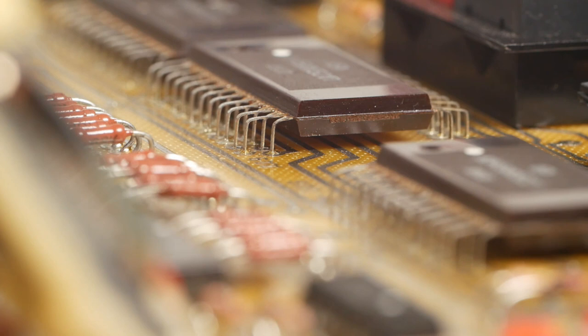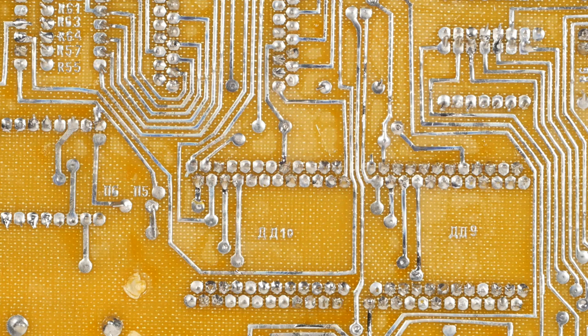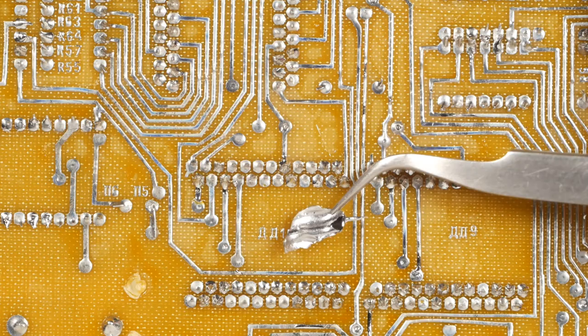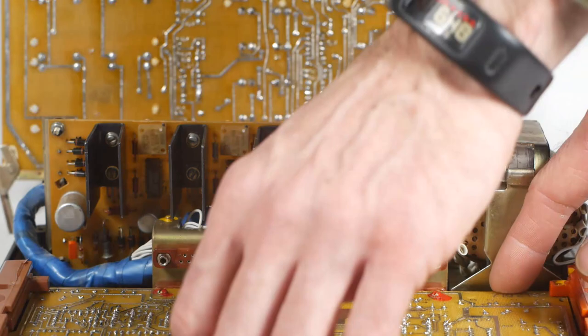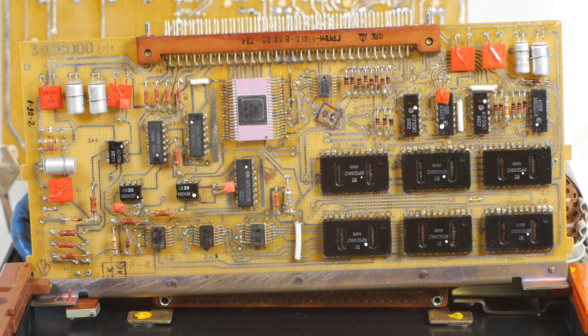On the inside it's an alien-looking world, with these strange chips with their double-spaced legs. Then there are others with open holes in the chip body, like this. The soldering was shocking, and there were stray blobs everywhere, this being by far the biggest. But none of them appeared to be causing a short circuit anywhere. There's a second board beneath the main one, and both boards plug into multi-way sockets, which is nice. The lower board has more of the chips with the holes through them — I think this one is largely for the analogue-to-digital converter.